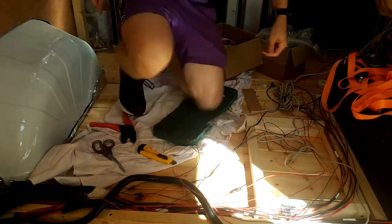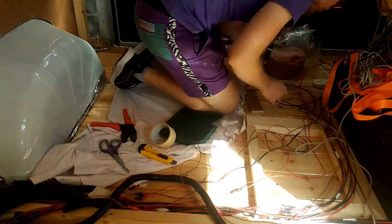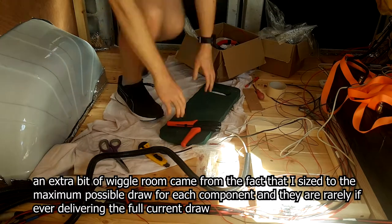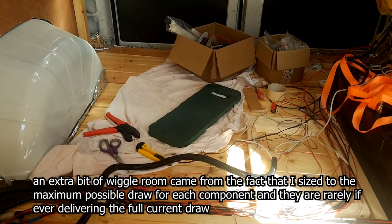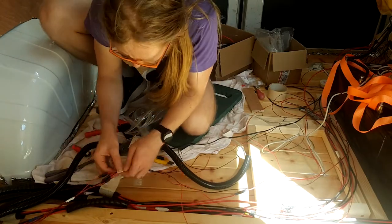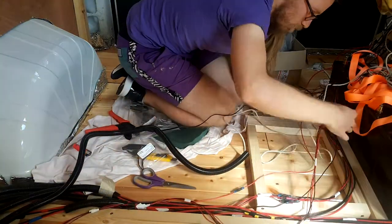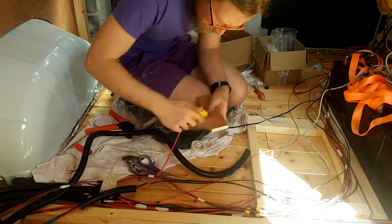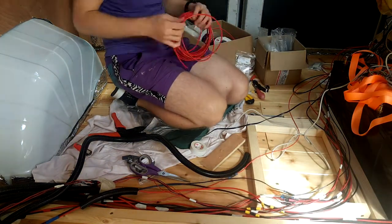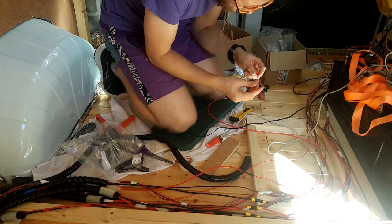There's also the added stress of additional voltage drop from longer cables. Thankfully I'd calculated things in a way that left some spare, and when I ran the numbers again with the extended cable length, everything seemed okay. I think I generally oversized my cables. Everything still works, so it obviously wasn't bad enough to cause issues — though maybe the lights could have done with a slightly bigger cable. It's a lot better to just get this stuff right the first time and overestimate on everything wiring related.